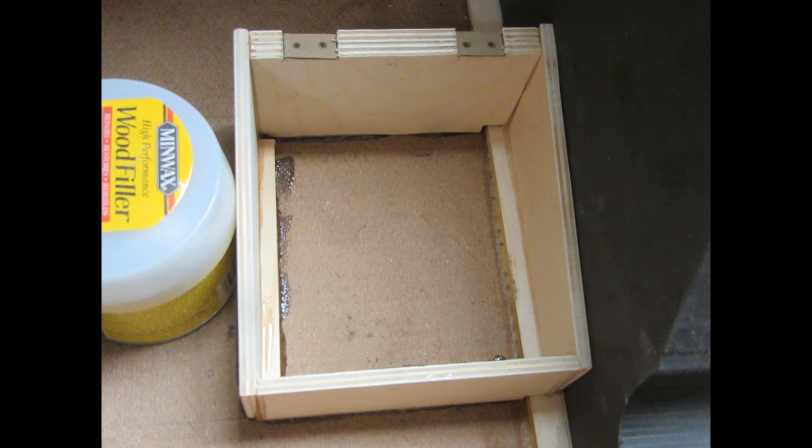To assure that the sides of the box are well attached to the case structure, I look for ways of increasing the surface area to be epoxied. The rear panel is already double thick to allow mounting of the hinges. For the left side and front, I added small strips of scrap wood. The right side gets some support by being up against the second foam pillow block, and indeed I used some Liquid Nails adhesive between the wood and the foam in this location. Note that I decided to raise the hinges slightly for better fit of the lid, so I added some shims made from cardboard taken from the back of a pad of paper.